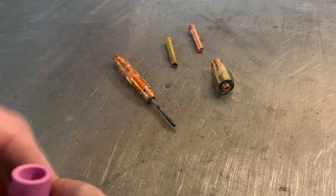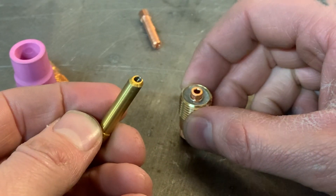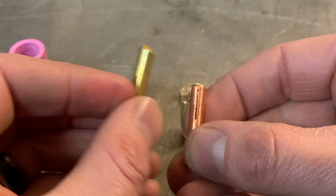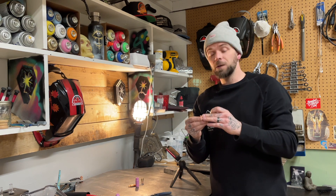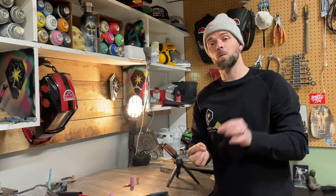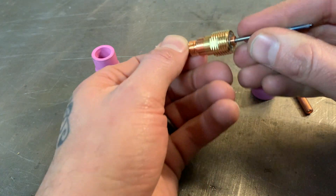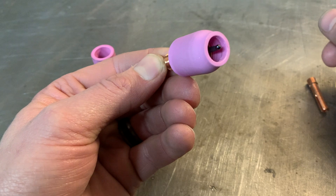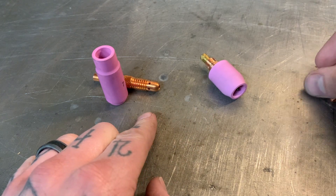So putting the diffuser stuff aside — this is a gas lens setup, which I prefer when doing TIG welding with aluminum. I prefer using these wedge style collets. The other option is a split wedge collet. The wedge style collet does not have the slit opening in the middle. The reason I prefer wedge style collets is that the ones with the slit tend to overheat pretty quickly, and because there's less material to support the tungsten, they tend to warp and lose their shape. So I definitely prefer the wedge style — you'll see less distortion and they last much longer. The wedge style collet slides inside, holds your tungsten, and your cup goes over the outside. It's a slight difference in performance. I do prefer the gas lens setup nowadays, but a diffuser setup works fine too — it just depends on what I'm doing.